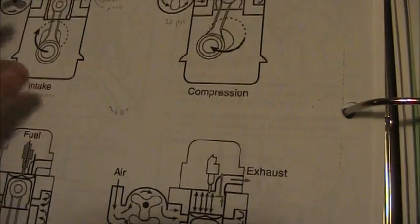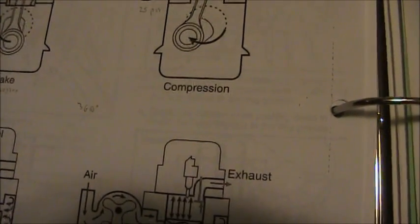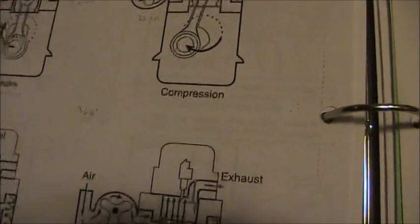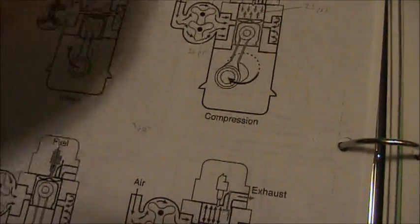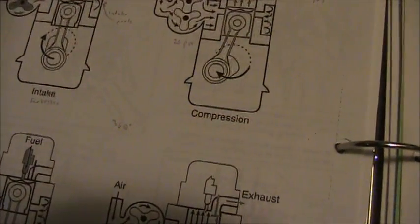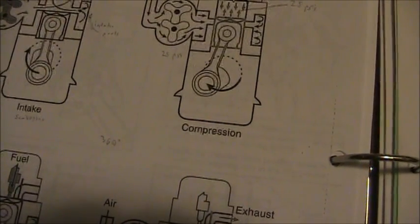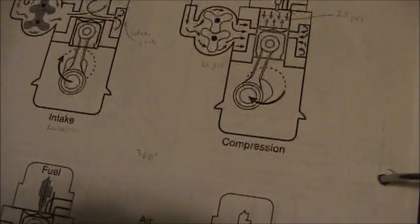I think the power band is around midway through 600 RPM and it doesn't go much further after that. So what they did is come up with a two-stick transmission to keep it in its power range. You can't lug with these engines at all, but if you stay in the sweet spot of the power band these things can make a lot of power.